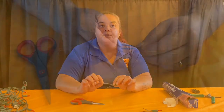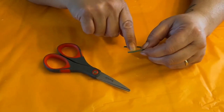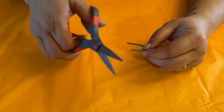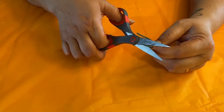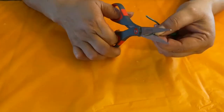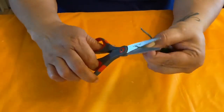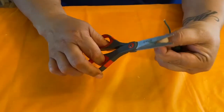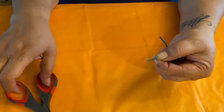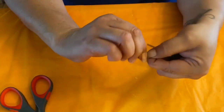I've adjusted the camera angle so you can see my hands and how I'm going to use the scissors to cut the rubber coating off the wire. Take your scissors and put them over the white wire, gently squeeze to apply a little bit of pressure, making sure where your fingers are placed, and give the scissors a twist. Take your time — don't rush. Turn it back and forth giving a little pressure, then take off your scissors and set them down. Find that little scored joint, put your fingers right there, and give it a twist.